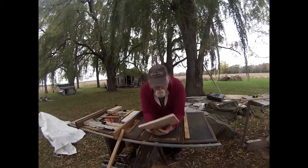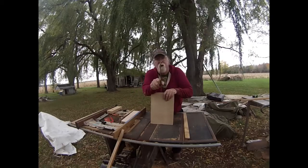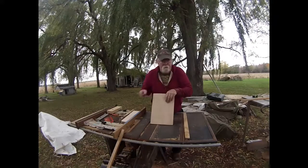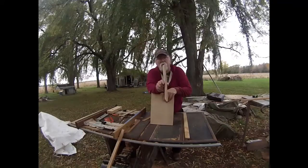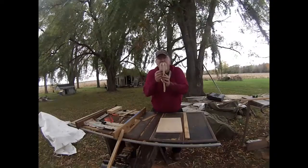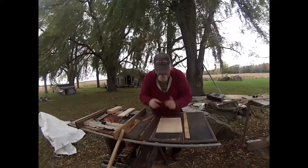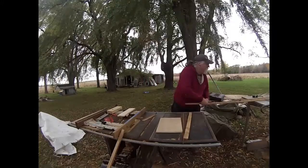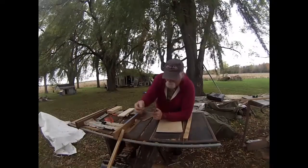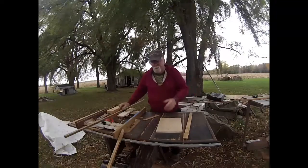Okay, so a lot of skull sweat goes into this. I want to make the edges the same thickness as the strips on the ceiling, which is 3/16. The first one I'm doing is to go over 1/2 inch plywood. So 1/2 inch, 3/16 on either side. I want to make it 1/2 inch deep, so 3/16 on the top. And I came up with a piece that's going to be 14/16 wide, 11/16 tall, and then I'm going to route out or use the dado blade to cut a 1/2 inch groove down through.